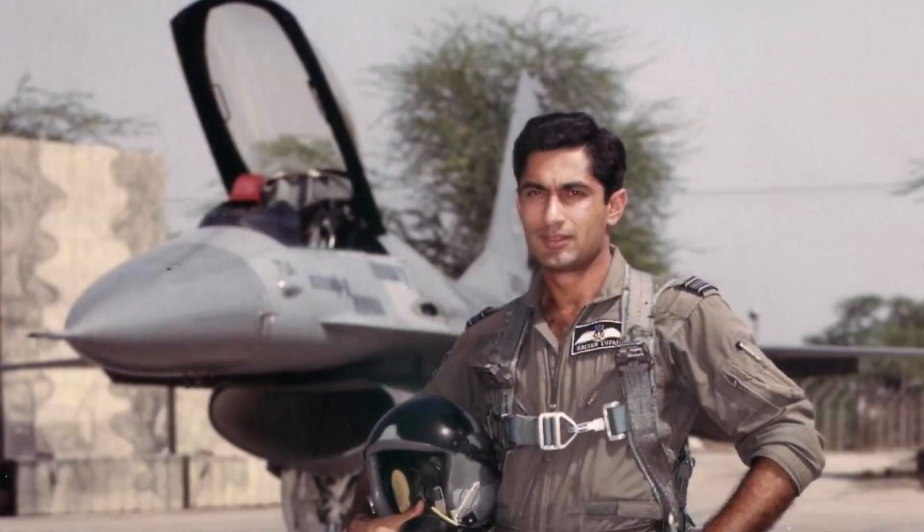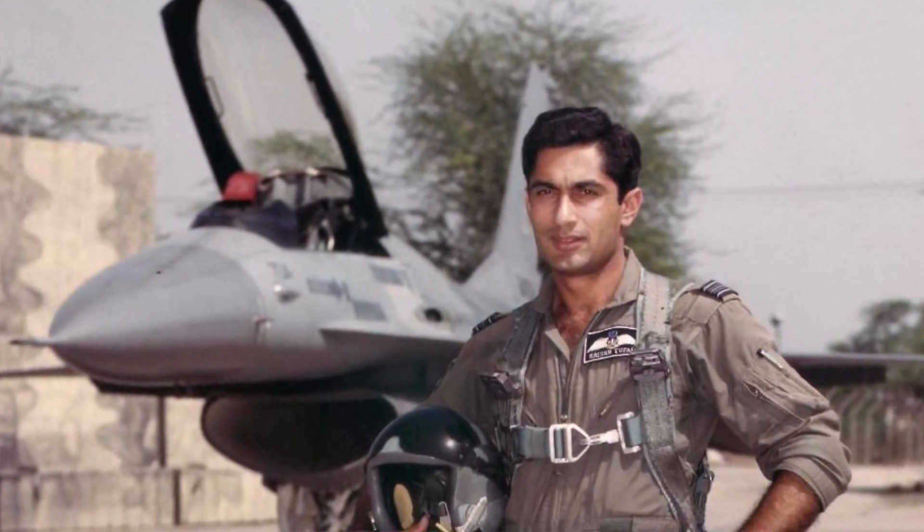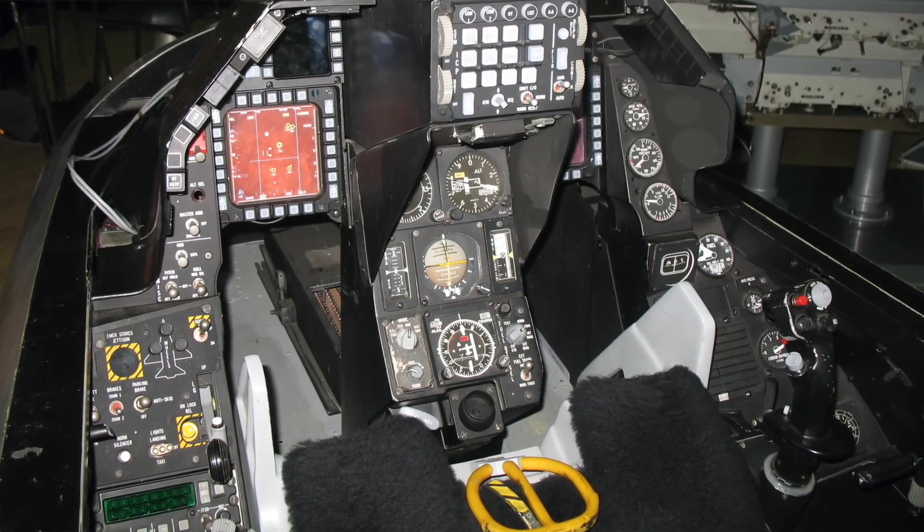The things that struck us were significant because everyone in the Air Force had been flying conventional fighters. On the F-16, everything was angular. Starting with the seat — it's 30 degrees reclined. The stick movement was just 1/16th of an inch in each axis; it was more like a pressure transducer. It senses pressure and the aircraft would just go around and do a loop. That was stunning. The stick was on the right side and you had an elbow rest, like you have on a car door. The first time we flew, we thought this was the most natural thing, and we wondered why the stick was ever placed in the center.